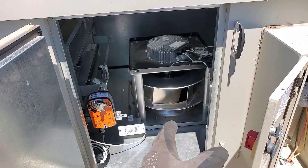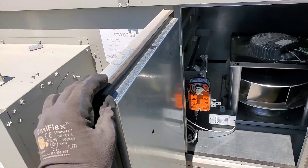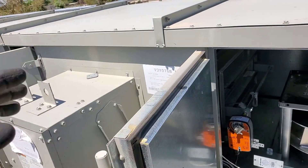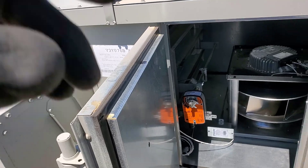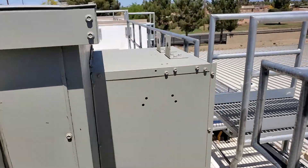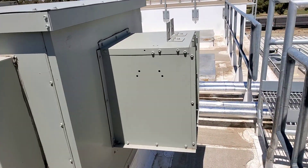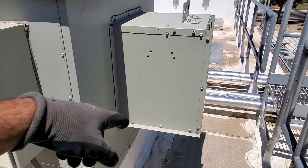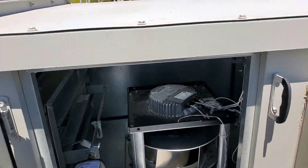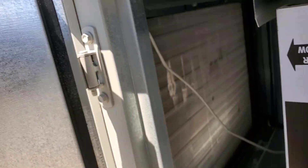Being that this is a return air fan that brings the air and pressurizes the return cabinet, you can use modulating dampers to proportionally bring in outside air and exhaust the inside air. There's the exhaust damper right there. This is my first time seeing this exact small version of these air handlers - it's small, like ten tons or something. As that proportionally opens, the air goes into the next compartment - your open compartment, filter, dampers, and your coil.